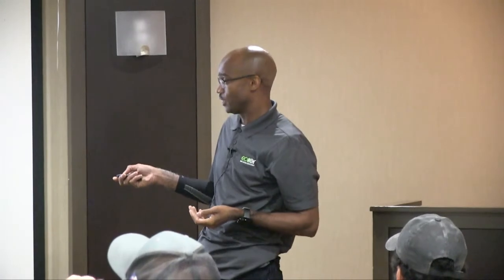So I had to explain to him, hey, you're using less energy by not starting on and off, because every time you start, you're putting maximum amps. Your starting amps are pretty high. But with an inverter type product, it's just maintaining. If you look at the current draw on these units, you'll see sometimes 5 amps, 8 amps, 4 amps, very low, depending on where you are in your cooling or heating cycle.